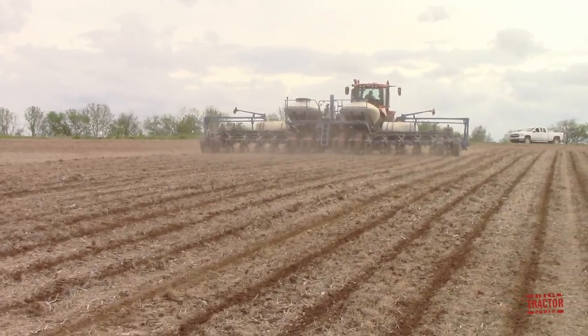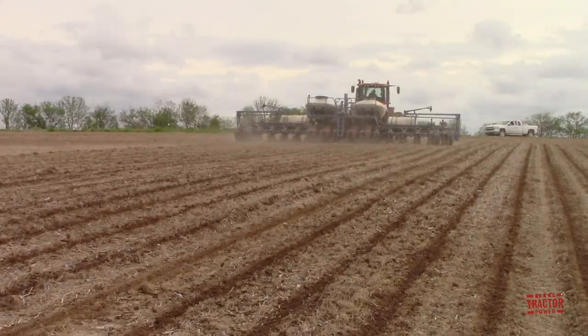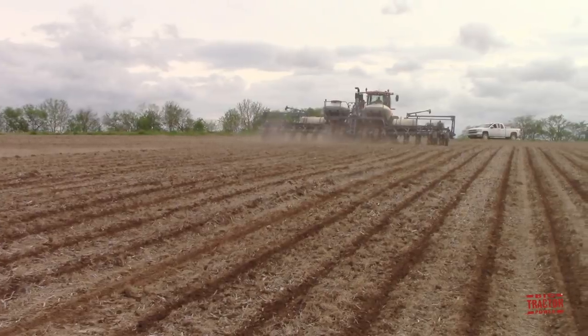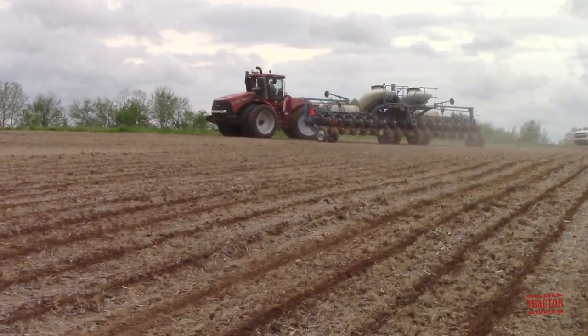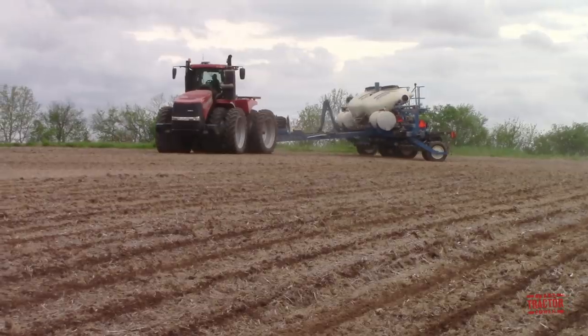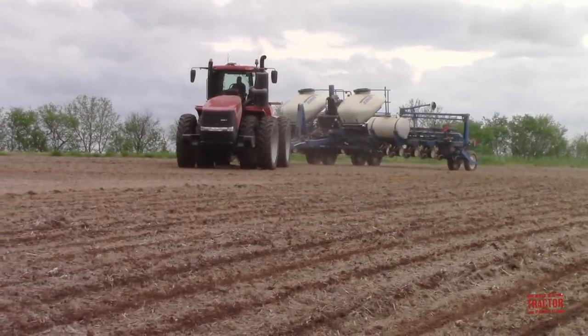It's manufactured by CNH Industrial at their factory in Fargo, North Dakota. It weighs in at 40,159 pounds. It's powered by an FPT 787 cubic inch, 12.9 liter engine. It holds 310 gallons of diesel fuel and 42 gallons of DEF fluid for clean engine solutions.